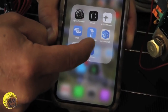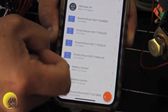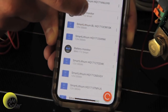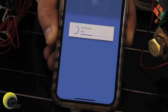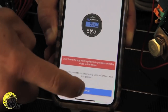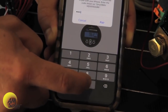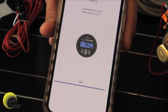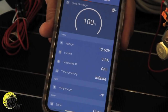To connect to the Bluetooth function of the BMV you will need a smartphone — iPhone or Android — that can run the Victron Connect app. Download the app from iTunes or the Google Play Store. Make sure your BMV is connected and powered up and your phone has Bluetooth enabled. Open the app and log into the device. When you first log in you may be asked for a PIN number — this is six zeros: 000000. As you connect, the BMV may receive a software update through your phone; this shouldn't take long. Once connected, you have a very friendly user interface that gives access to all the features of the monitor.